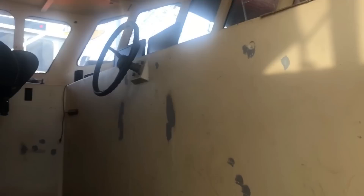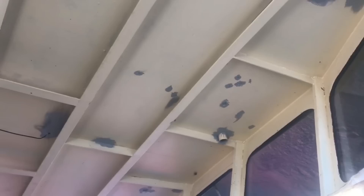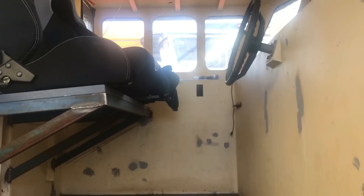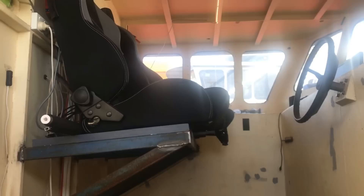That whirring noise is the heat of the air coming down there. In the wheelhouse you can see all these spots of grey everywhere - there's a bunch of random bits of weld or rust or something like that. Jess has gone through and touched up any areas that needed to be touched up, so all of this is going to be getting painted in the next few days. She's done that this morning. It's a bathroom extractor fan that we've modified to suck out of this room - it sucks all of that air and paint fumes out. We've got a fan set up here that's basically constantly pressurising this room, and then it's all getting sucked out of that blower over the back.